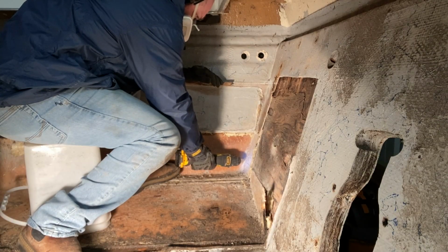It's going to make it a little bit easier to replace the transom and get all the wood out and clean it down. That way I know for sure it's going to adhere to good glass, and I'm not going to have to worry about whether I got that one spot in the corner of the transom that I didn't have an easy way of getting to. So that's the way I'm going to do it. Right now I'm just going to cut it all out, remove the rotten wood and the glass, and get down to the gel coat, the fiberglass on the other side, on the exterior of the boat. So that's the plan. 1, 2, 3.